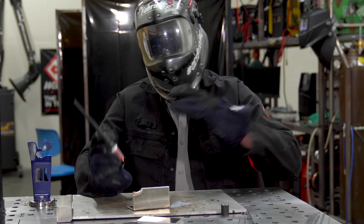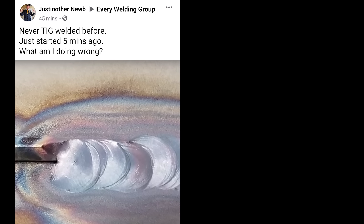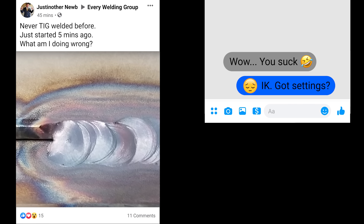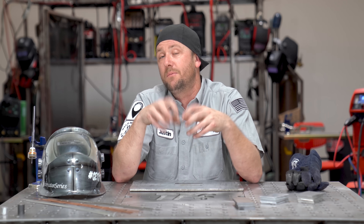Finally, number three: commitment. When you first start TIG welding, you're going to melt a lot of metal until you get it under control. You're never good at anything you've never learned, and TIG welding is no different. There is no universal setting that someone is keeping from you — there is nothing you're missing except knowledge and skill, which is acquired from practice. Those settings you got off Facebook welding groups after posting your first weld with the 'what am I doing wrong' caption are the settings that worked best for that person. When you plugged them into your machine, you probably melted down a lot of metal and said, 'Screw it, I'll just turn the amps down.' And that's exactly where you screwed up. Coming in too cold means you don't have enough amps to form a weld pool and melt the filler wire at the same time. What happens is a puddle-shaped shiny spot appears on the metal resembling a weld pool — you go in for a dab, but it just balls and melts away because there's no energy to melt both of them.